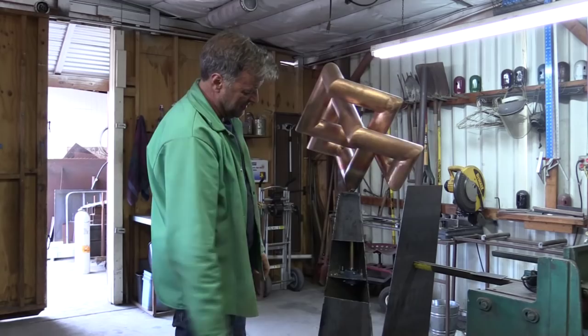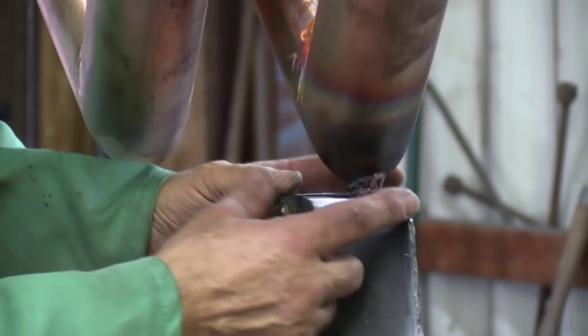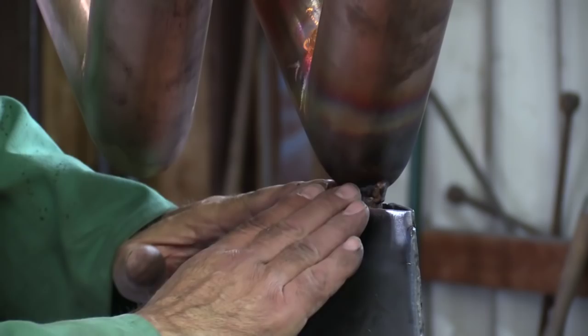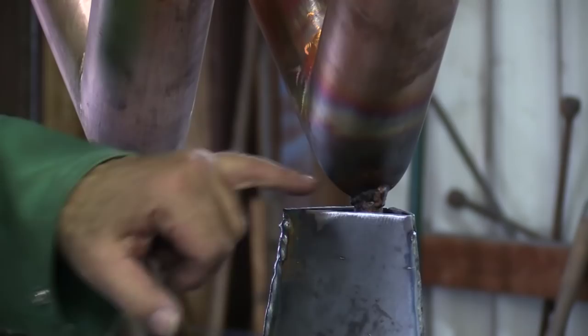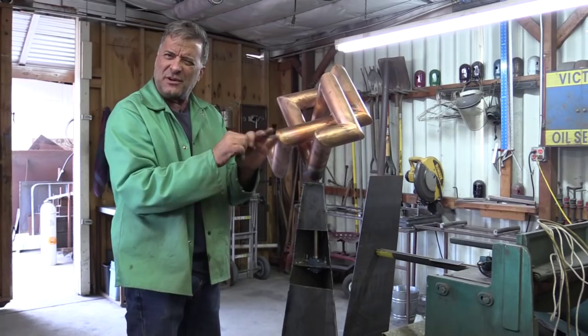I got a little shot of grease in there on both of those bearings so they spin a little bit easier. For finishing it off, I'm going to come in here on this triangular-shaped top and cut three pieces that are going to go up at just a little bit of an angle, with a hole right there in the middle for the shaft to go through. I have to grind all this down smooth, get the tabs on it, get the door made, get them threaded, and find some countersunk screws so they'll look nice and flush.